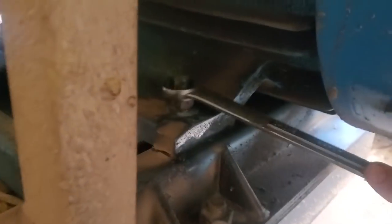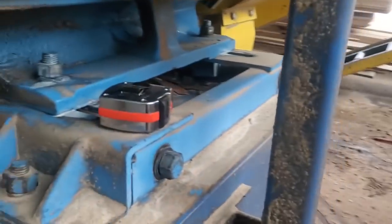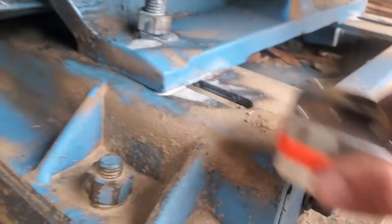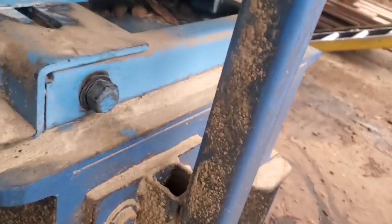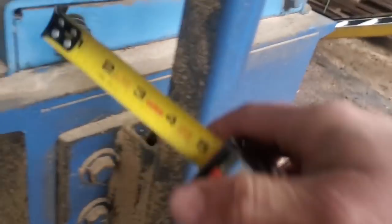And I'll tell you another thing, and this might just be, you know, everybody's got their own way of doing stuff, so I'm not knocking anybody else's way of doing stuff, but, oh, bless America, uno mas, por favor. I never, when it comes to tightening these, a lot of people like to put an impact tool on there. I never put an impact tool on there. I lube them up good. Of course, I try to move it even, Steven. Usually when you're doing a belt pulley, one end of your motor you got to push back on, the other end more to pull forward.